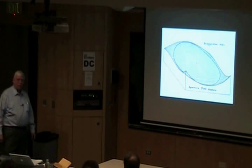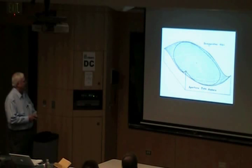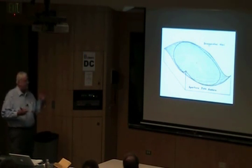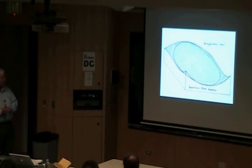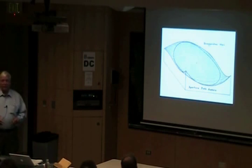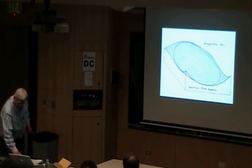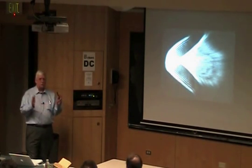Tom, it's the one I gave you this morning at breakfast. Same thing. But that's what it looks like, and it's a relatively simple shape that's convex and concave. But over that rather small diameter, of not much more than 1/10 of an inch, is a power change of close to 18 diopters. And the whole thing has a vertical relief of only about 2/1000 of an inch. So it's a rather remarkable little freeform, and it wasn't all that trivial to make, but they were very easy to mold. They were all good. Anyway, if you just shine a laser through a thing like that, you get a spot on the wall. It just shows a beautiful coma pattern.